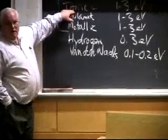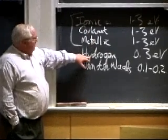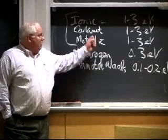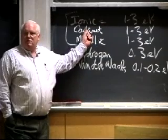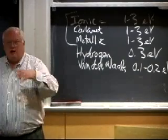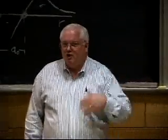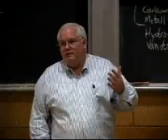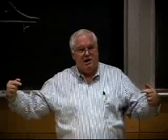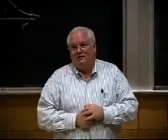Ceramics are ionic or covalent. Semiconductors are covalent. Metals have metallic bonding. Van der Waals bonding is found in, actually, let's go to a polymer. A polymer has a backbone chain of covalent bonds, and between the chains you have van der Waals bonds. So how do I get Kevlar, wherever that X33 space piece is? That honeycomb core is made out of Nomex, which is another brand of Kevlar, if you will. And Kevlar is very strong because they align all the backbones of these polymer chains in one direction. They talk about Nomex or Kevlar being stronger than steel, but only in one direction.